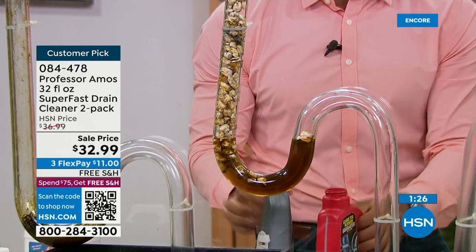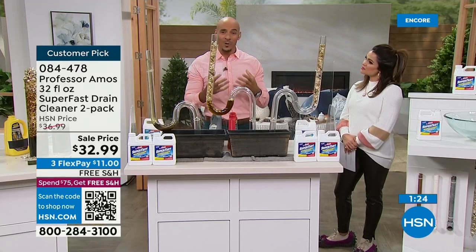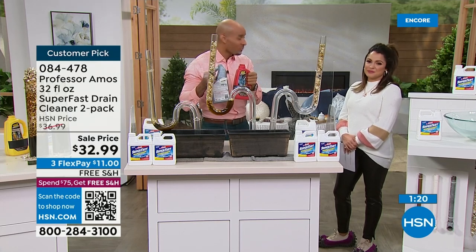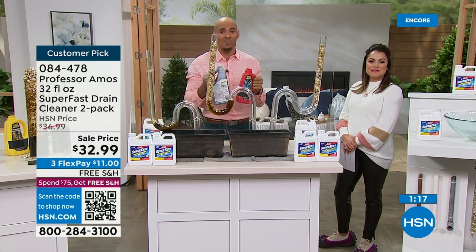You don't want heat in your drain line, especially when your drain lines are very cold, because when they go from cold to hot fast, they'll crack. We don't want a crack. Not right now. It's too cold for a crack.